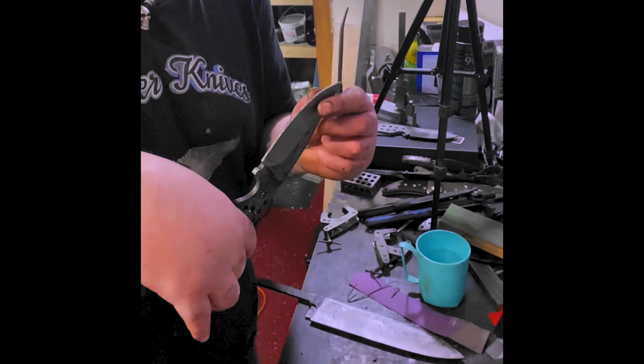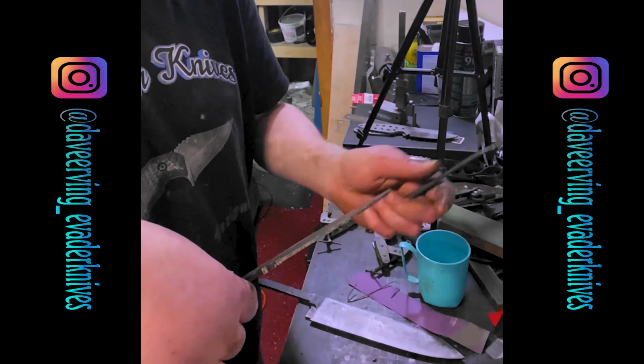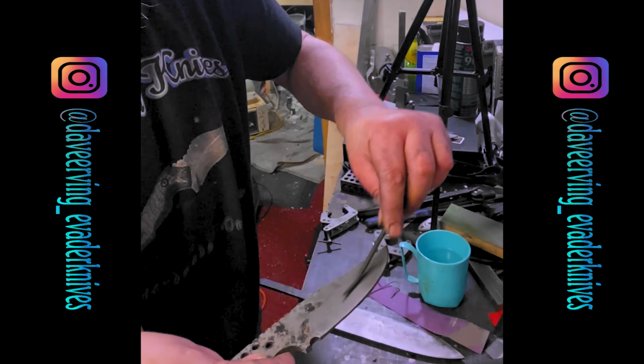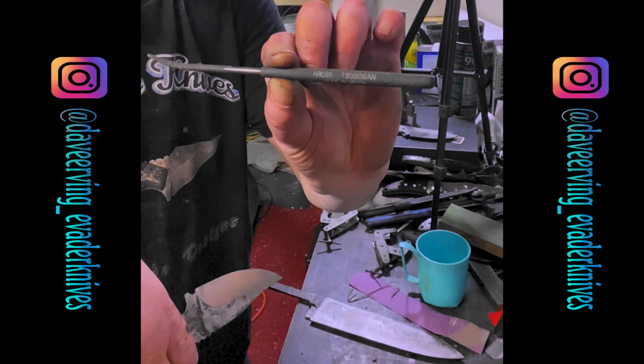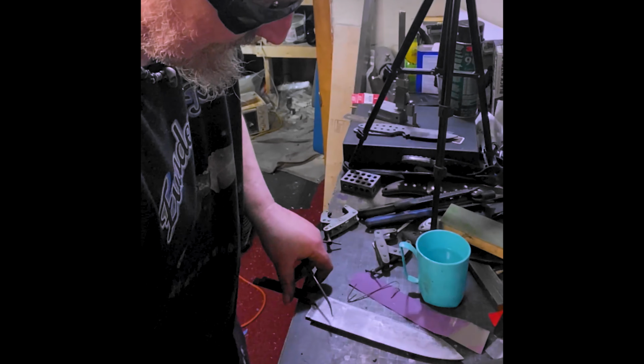And then we got this one. I went and cleaned the bevels off. Then we're going to throw it in temper at like 410, maybe 420 for 2 hours, one cycle, and then let it cool down. But yeah. This is a 65. Boom. Not touching it at all. That's what I had to do.